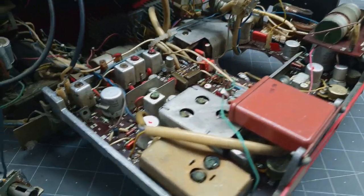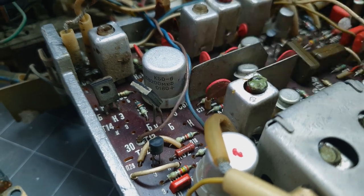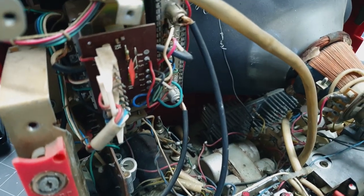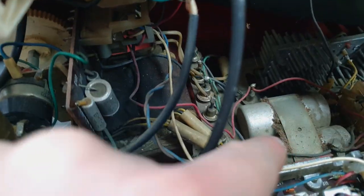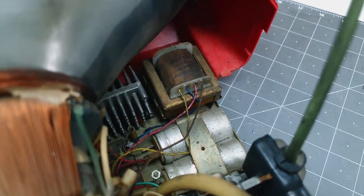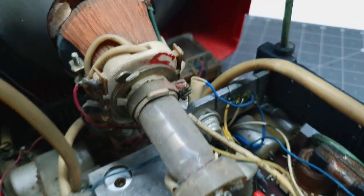Okay, we're inside. Let's see what we've got for dates — there we go: 01 1980, so January of 1980. This is a 1980–81 television. Solid state, of course. Everything looks pretty clean, not seeing any major areas of catastrophic failure. Down in here that's our main transformer, there are our two main filter caps. The horizontal output transistor is probably on that massive heat sink. There's a secondary transformer — not sure what that's doing — with its own pair of filter caps. Didn't expect to see two large transformers.